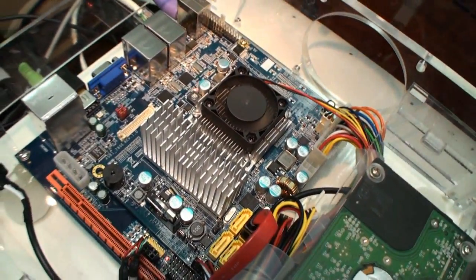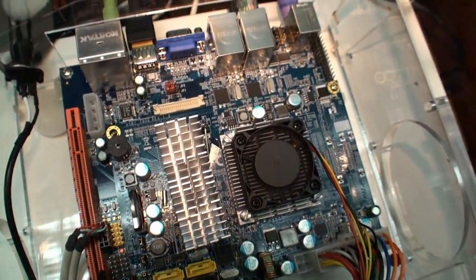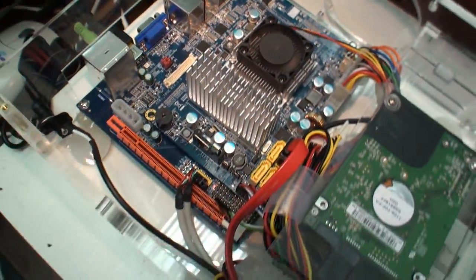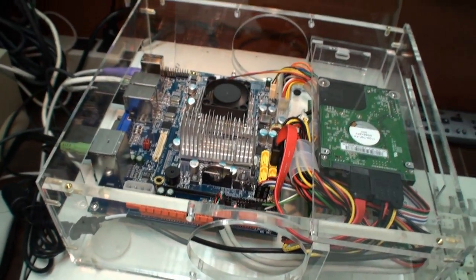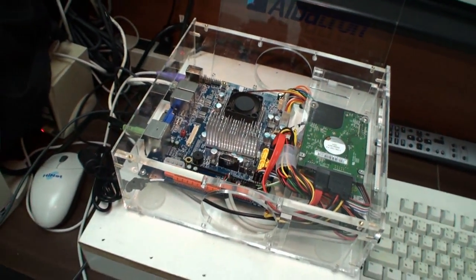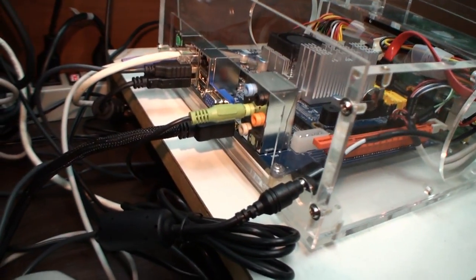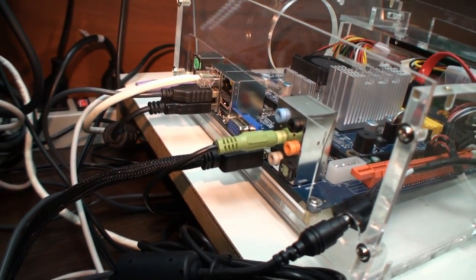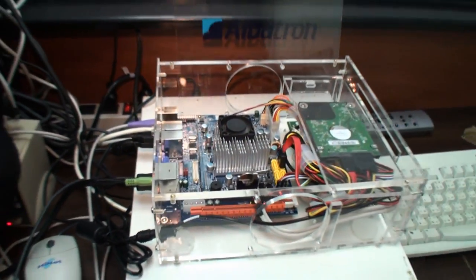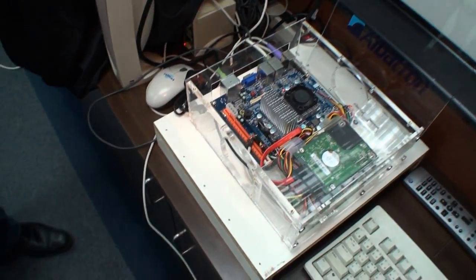It's based on an embedded CPU family of AMD, ASB1 as they call them, and this system is running on the dual-core BGA type L325. Full functionality in a 3.5-inch form factor. It comes with an additional second layer board. It is an I/O board, and every time some customer has a different need for different input-output, we can just redesign it for him in an instant.